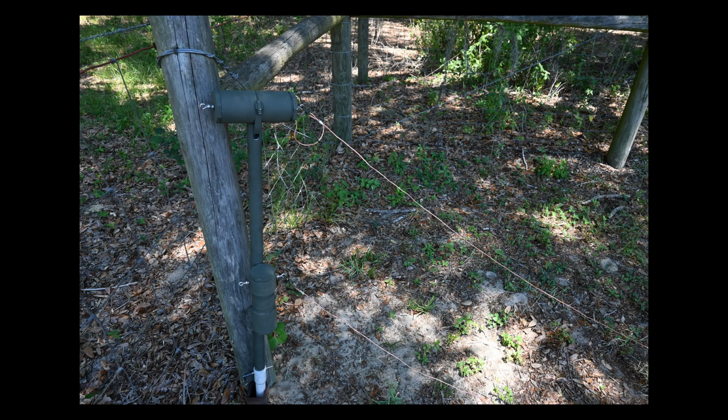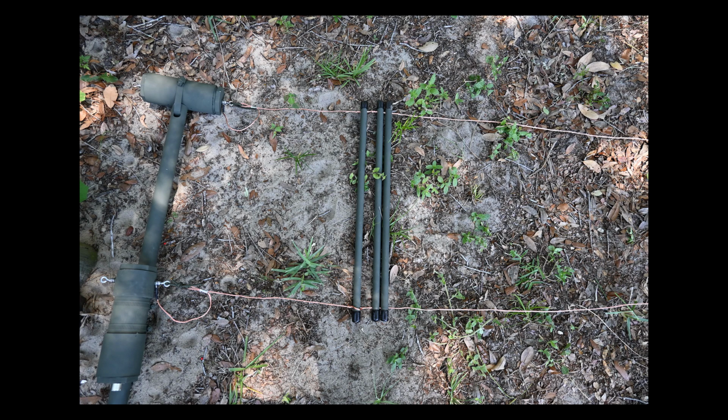I took the wire element sub-assemblies assembled earlier and attached them to the transformer and resistor support assembly using Fisherman knot loops of 550 cord as discussed earlier. Pay out your element wire evenly for the length of both elements. I then took 3 spreaders and threaded them on the wire elements as shown.